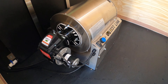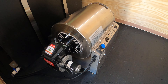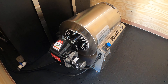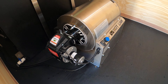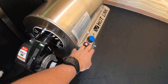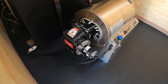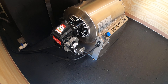Up here we've got our burner. It's passive, so anytime that it's not on, it's not heating the water. This system has enough power that a lot of the pressure washing you can do with it will be cold water, but when you get something that's really dirty, or maybe you're using your flat surface cleaner, or you're working on oil and grease, you can just click on the burner. Boom — runs on diesel. It'll heat up that water. It's a 140-degree temp rise, so if it's 80 degrees out, you've got 220-degree water. It's hot.